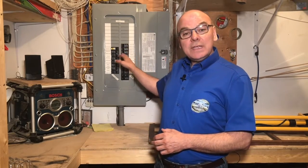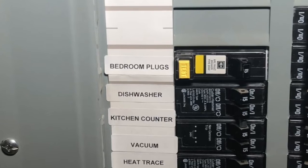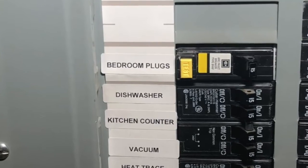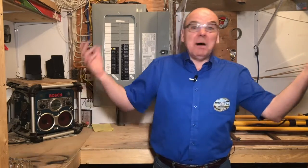You may have noticed the test button on that breaker. It is meant to test the AFCI's operation. In previous weeks, I had you test the GFCI in a washroom, but this is different. This circuit has alarm clocks on it, computer, and maybe the pump to an exotic fish tank. So I would suggest not testing it in order to avoid getting an angry phone call later.